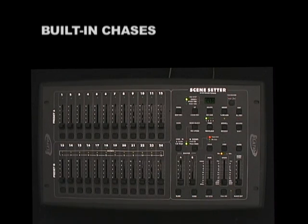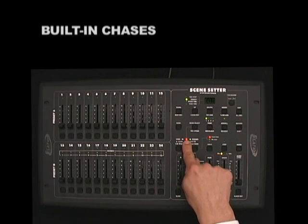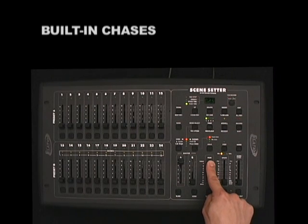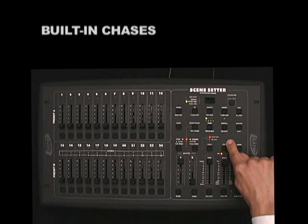To play back a pre-programmed chase, press the Mode Select button so that the red LED next to the Scenes text comes on. Set your master fader to a desired setting. Set your fade fader to a desired setting. If you don't wish to incorporate a fade time, set it all the way to the top so you get an instant change. And set your speed fader for your chase rate. You can see the chase rate with the green LED flashing above the step text.